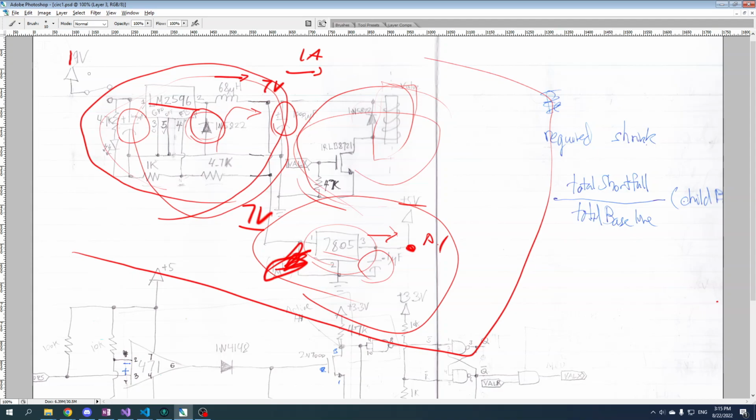Here you just see I've got a switch that connects the entire thing to the power supply, so I can turn it on and off without unplugging it from the wall. And then here I also have an LED that just tells me whether or not it's on or off. That is my power indicator. I thought 4.7 kilohms would be enough, but it's not. This thing is way too bright. But I'm not going to change it because it's all soldered in there, and it's not a huge amount of electricity wasted anyways. It's just very bright at night. I had to put something to cover it here.